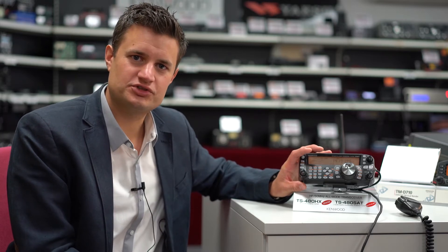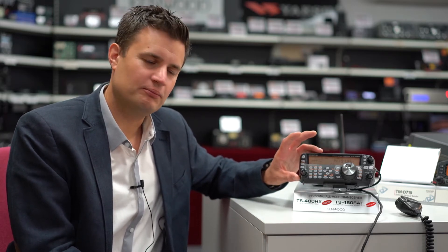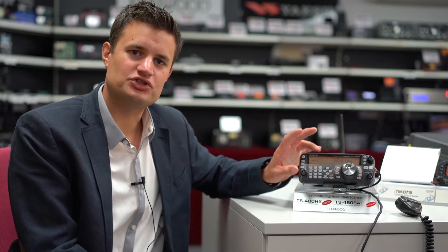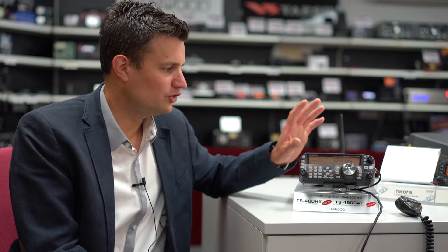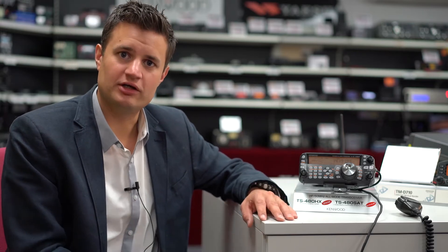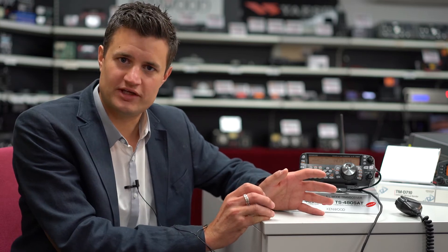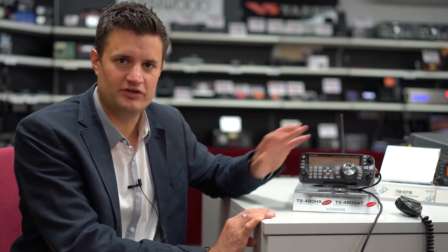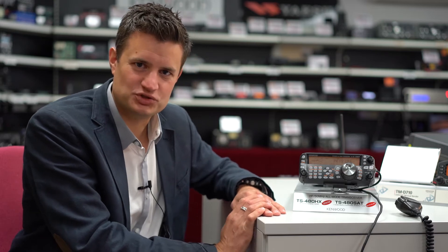The TS-480 was the original transceiver idea for the remote rig solution, mainly because of its ease of setup and the fact that it has a detachable head. It allows you to just buy one radio and use it wherever you go. Half of the radio — the main body — will live at one location co-sited with the antenna. The head unit is transported around with you and you can take it anywhere in the world and still access the other half of the radio. The way you do that is use the internet to connect one half with the other — it's like a very long microphone cable or a long coax cable connecting you to the antenna.